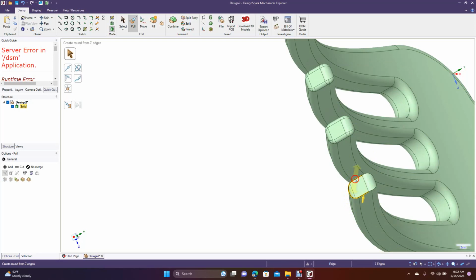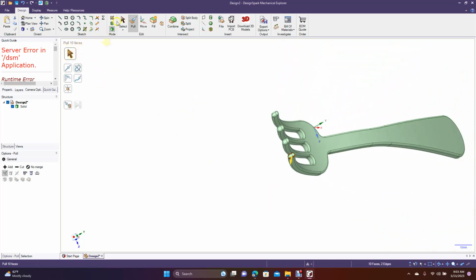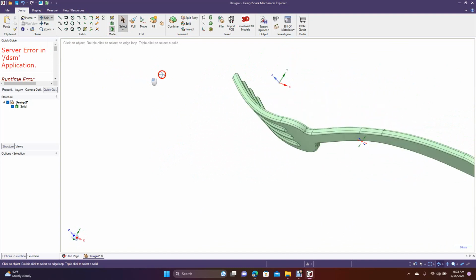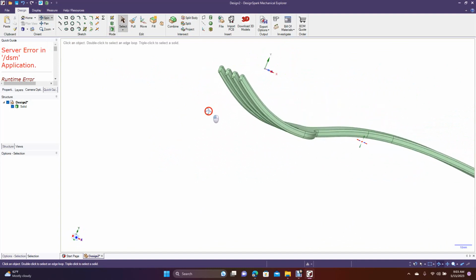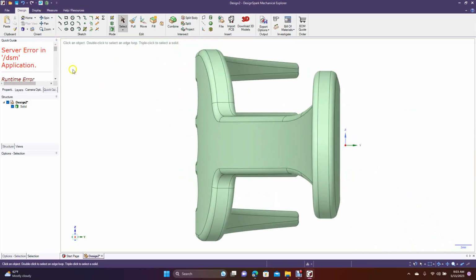If you wanted to do a spoon, the spoon is similar, except you need to create another profile. To type in 0.5. Okay, so we'll go ahead and Control minus. We'll click here to select off of it, and then we're going to go ahead and spin this. So this is going to be our fork. A spoon would be a little bit different. Let's go ahead and view this. The right. Actually, I wanted to do front.